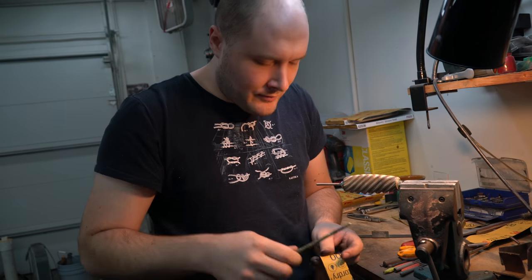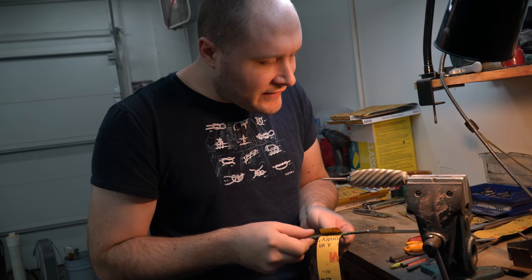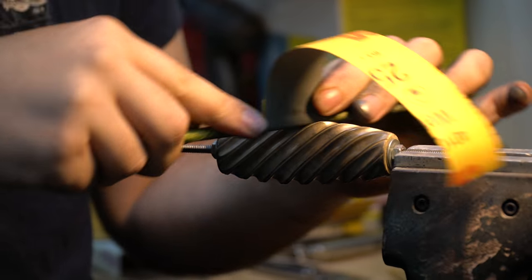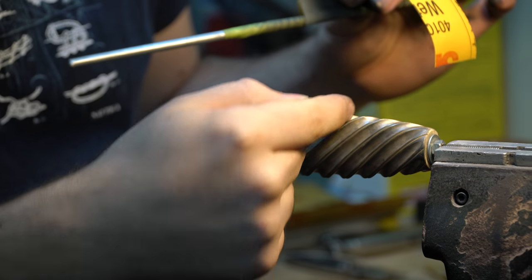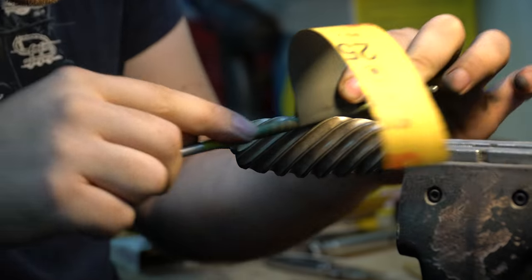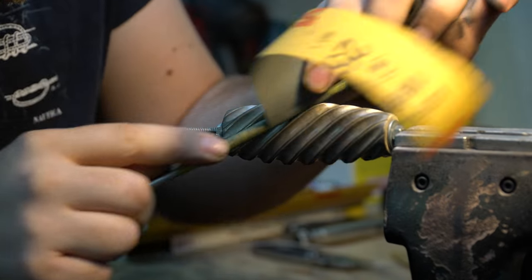So I just take it and hold my paper on here at the desired area and just start sanding. I normally have to pull it against the side wall here just lightly and then I also have to push it against the far side just a little bit in order to sand the entire groove.